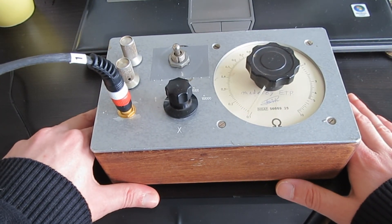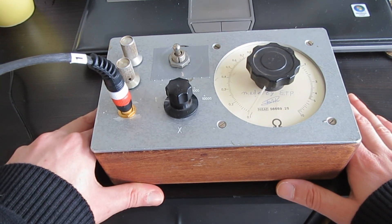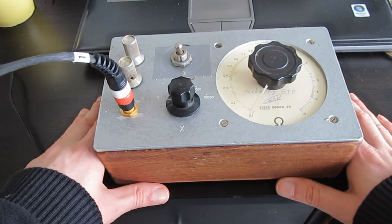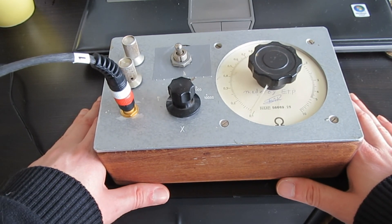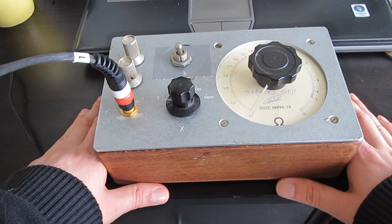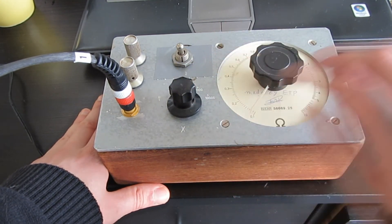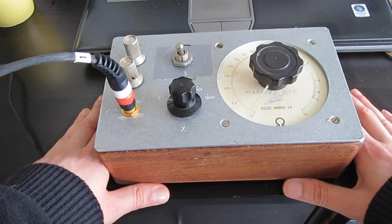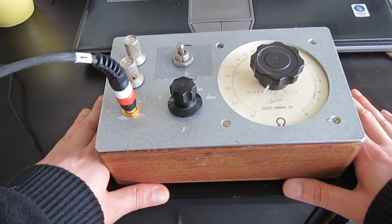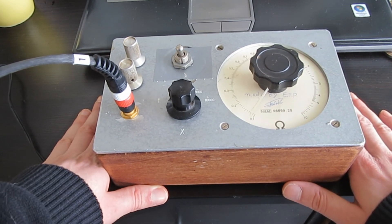However, things became a little bit different. A third oscillator came into play, acting as the frequency modulator. Really, it's some sort of weird signal-mixing voltage-controlled oscillator that acts as the third operator. In a way, you could say these are both modulators and the third oscillator acts as a carrier of sorts. Not sure how accurate that explanation is — it's a weird circuit.